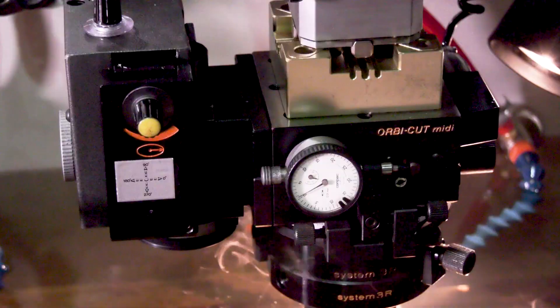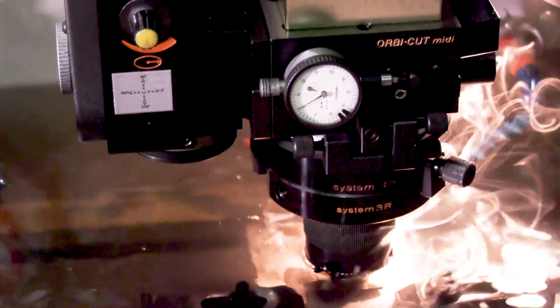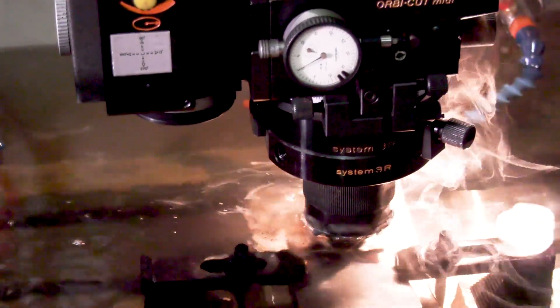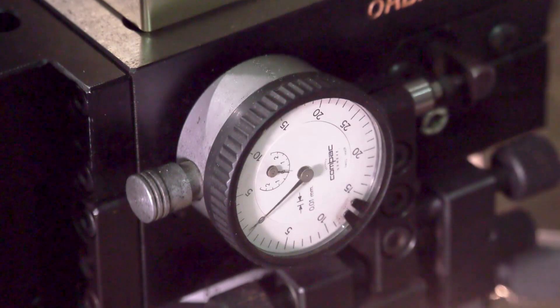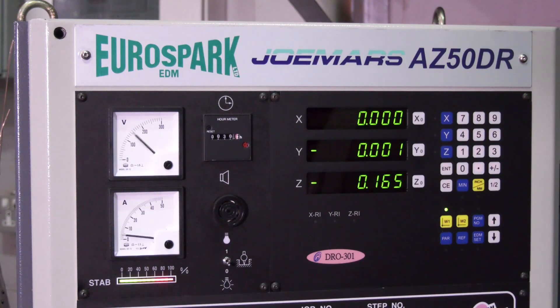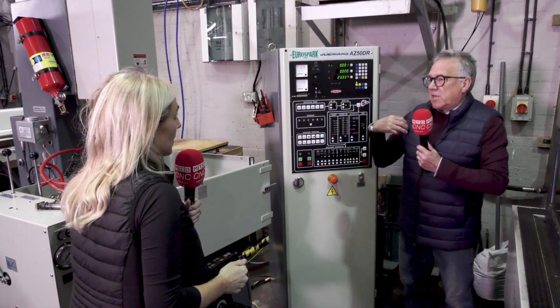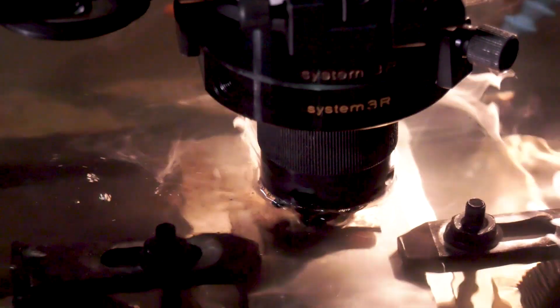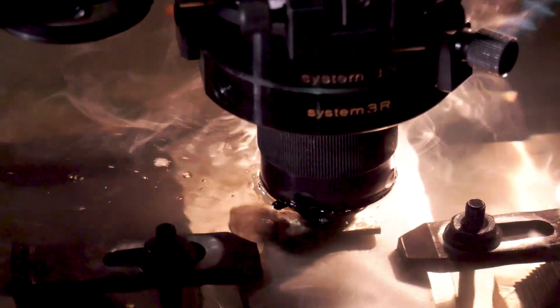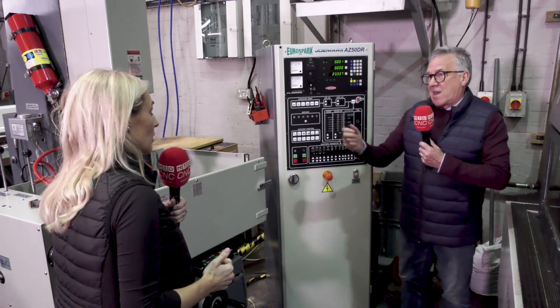Tell me about the extras before we hone in on the fuzzy control. What we did to get it close to a CNC machine was offer an OrbiCut system — although it's manual, it allows the customer to do a cavity and then check the cavity through a moulding. They might have got the shrinkage wrong because of the different plastic materials they use, and they can increase the orbit without making brand new electrodes, which is what they were doing before. It gives them the facility to do a straight burn, or a straight burn with a planetary or orbital movement, to give a better surface finish, more accuracy on the cavity, and the sizing they want for shrinkage allowances.